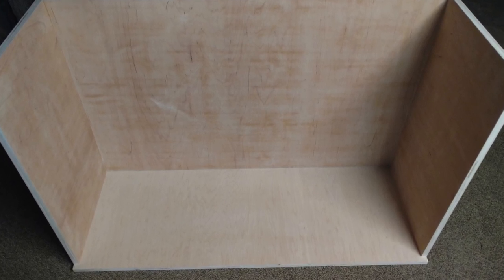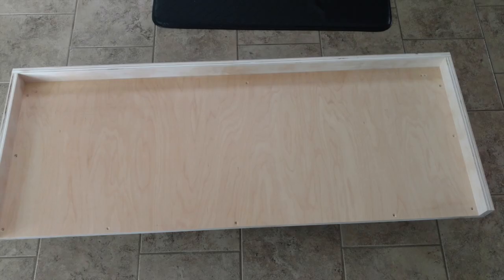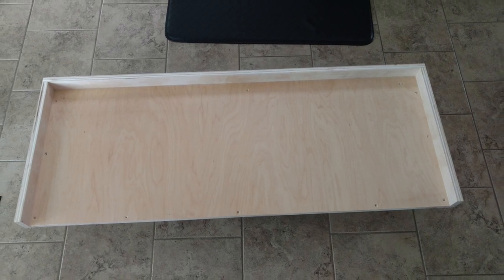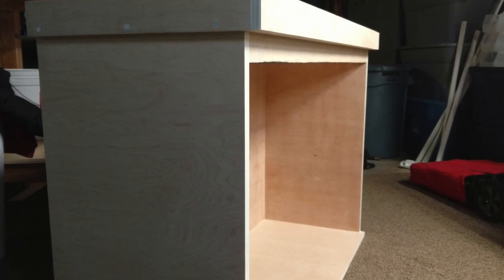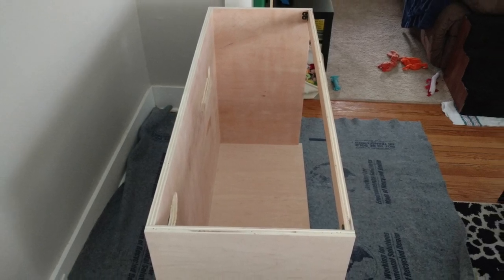Here's the start of the stand — you get three basic walls and a floor. Make sure they are glued and use good long screws for better anchoring. This is the top part, where the tank actually sits. I built a lip so it covers the tank frame itself, then put wood filler on all the screw holes and sanded it. I put a couple of layers on the bottoms of the stand — the legs stick in three-quarters of an inch so that when I put my doors on they sit flush.